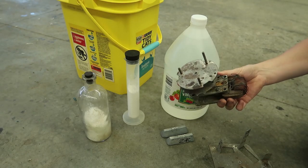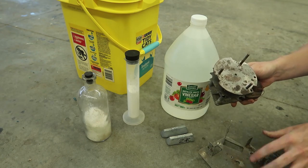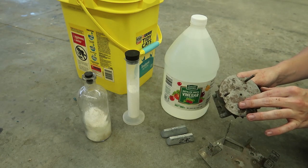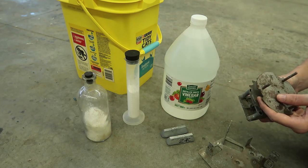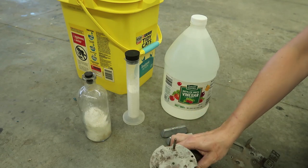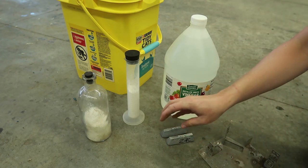I'm finally getting around to restoring the parts from those pinball machines that I found. Once I'm done sandblasting this metal, I won't be happy with painting it or covering it with an oil, because those seem like very temporary solutions. So I think we should do what the manufacturers originally did and galvanize them with zinc.